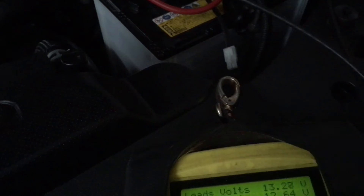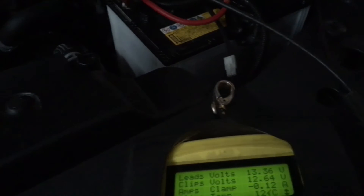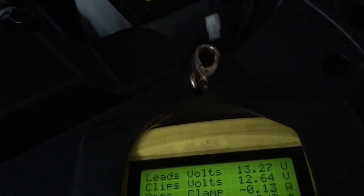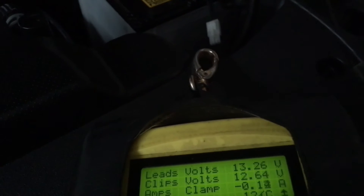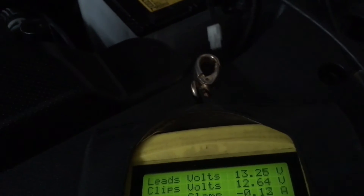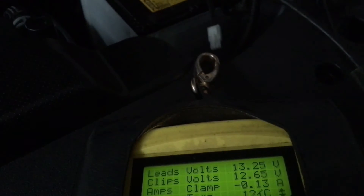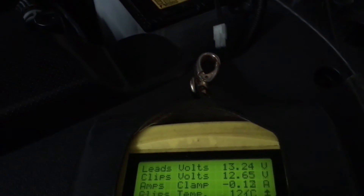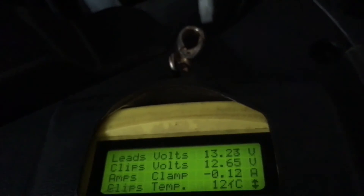So it's not a battery test, but it gives a really good indication. If it's not between 12.65 and 12.8 after charging and settling, you've got a problem. If you're having alternator issues, switch it off, check the voltage sitting there, and if it's like 12.5 after the engine's been run — your battery's rubbish, time for a new one. A charged, settled battery at 12.65 to 12.8 is the best indication I can give you. Outside right now with cloud cover I'm only seeing 13.24, but 13.24 is better than nothing.